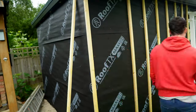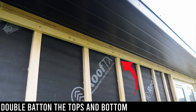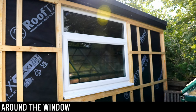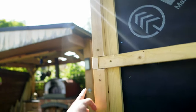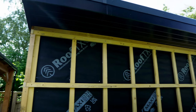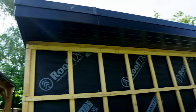Now all of those battens are up, but I've only done the front wall and it has taken the best part of three hours. Because this is much the same process throughout, I'm going to skip ahead to when all walls have been battened out. On screen you can see a series of photos showing exactly how I did the battens on every single wall including around the windows. On every corner I've put in an extra piece so the corner sections have something to butt up against. At the bottom and top of every wall I've got a double batten to ensure room for the covering piece as well as enough room to fix the cladding.